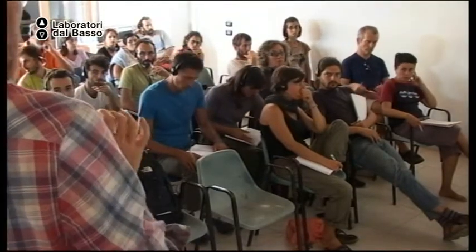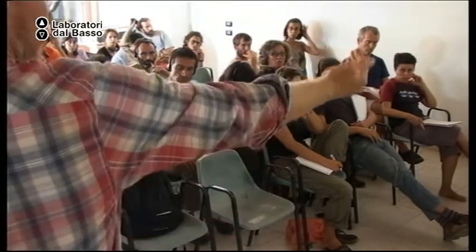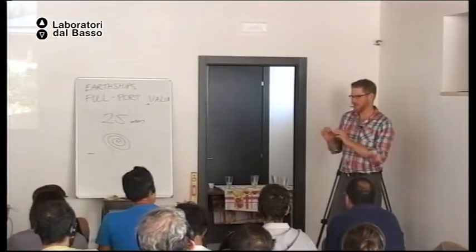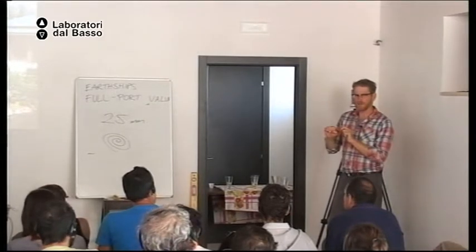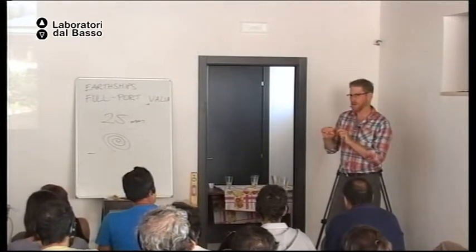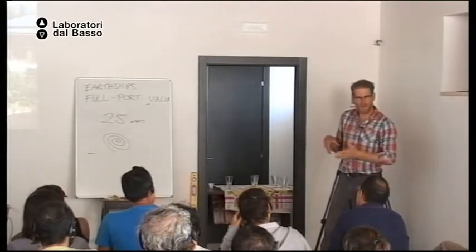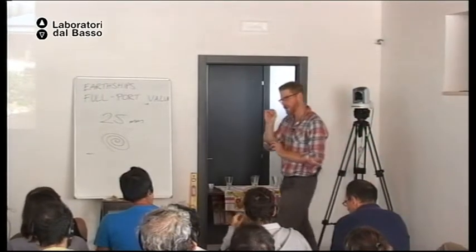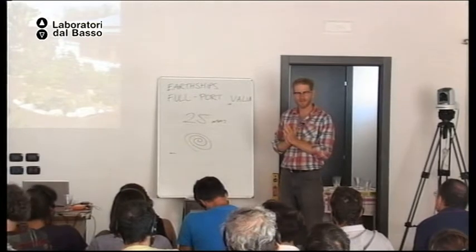It's better to have a 25-millimeter diameter pipe bringing the water to the garden than using a smaller diameter garden hose. Because if you have a small diameter garden hose coming this distance to the garden, the water will come out very slowly because of the surface friction of the smaller diameter hose. Does that make sense?